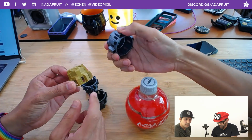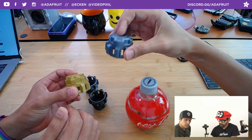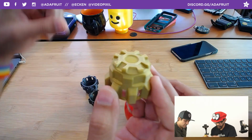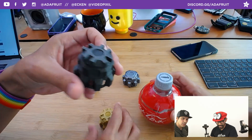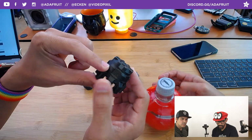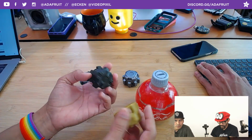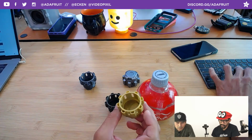The only thing I did was make the draft angles under 60 degrees, so it prints out very nice. You can see any close-ups on that. You can see how now the overhangs just look really good. I don't know what people think 3D printed, they look like bombs. They look like a Christmas ornament. That's what everybody's saying. Yep. So you can see the draft angles on that. I made sure that those were nice and printable, so the overhangs are nice when printed. No supports required for these, and they actually print upside down, so you get all that detail on there.